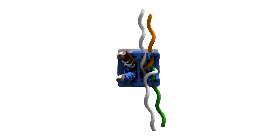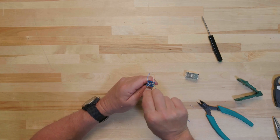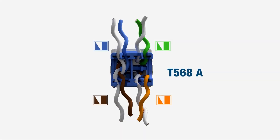Cross the brown and blue conductors around the post with the blue pair positioned to the outside of the post. The blue and green conductor pairs are routed to the outside of the post because it provides the most separation between these pairs, reducing crosstalk. The highest probability for crosstalk is between the blue and the green pairs. If you are terminating a Panduit copper connector according to the TIA 568-A wiring scheme on cable end 2, you can simply swap the position of the blue and brown conductors after they have been inserted into the wire cap, before they are seated into their respective grooves.